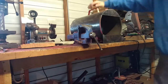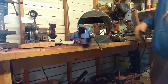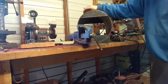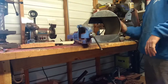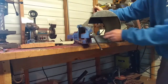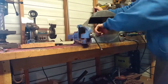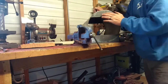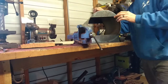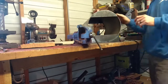I think that looks great — I think that looks awesome, it's perfect. My feet down here level it up, so I don't have to put any other feet on it now. All around, I think that worked out great. I'll clean these welds up here, the tacks on the top that you can see, and probably throw another bead around the inside of these just to ensure it all holds together well — because it is a lot of heat, even though it is insulated. I don't want warping and things like that.